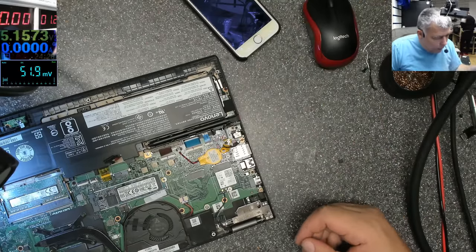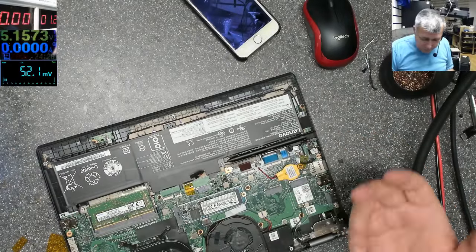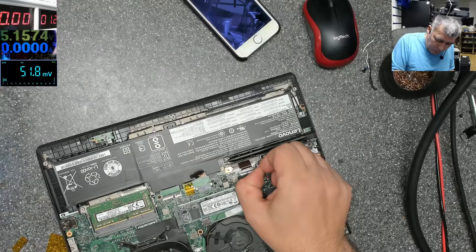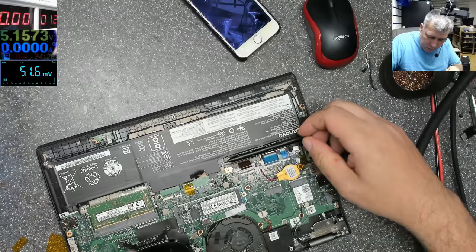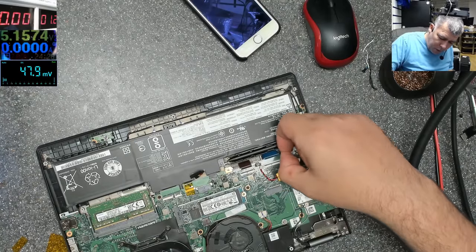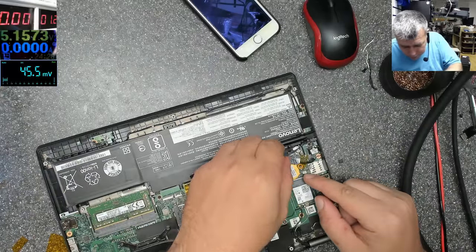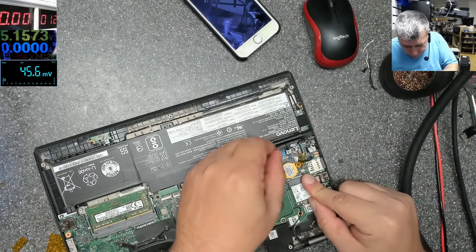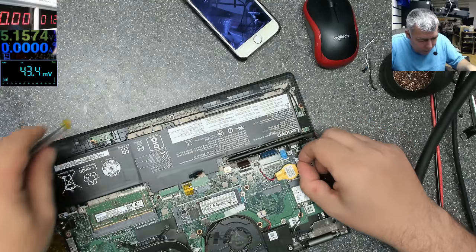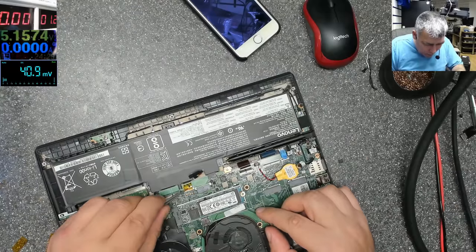So what does that mean? That means the driver is faulty, and the driver is telling the MOSFET to be open. Open wide. Let's find the driver. The output is weird. Output 1.2 volts. Why would there be 1.2 volts? I should have checked the output when I took out the MOSFET. But I was so sure it's the MOSFET. Because usually they are carrying a lot of current, so they are getting faulty. But looks like we replaced the MOSFET and it's doing exactly the same thing.